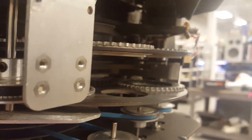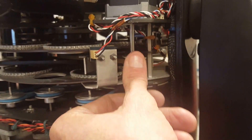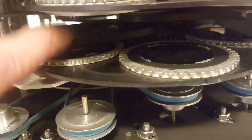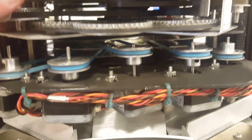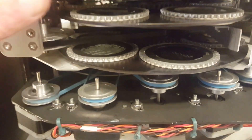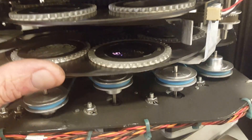If we move to the gobos — you have the gobo index, which makes the gobo spin on itself, and you have the gobo rotate, which spins the wheel. The way to adjust the index belt: it needs to be a little flappy, because if I put too much pressure on it when I try to move it, you'll see that the wheel will tend to rotate. If you put it really too tight, when you're operating the machine you'll turn on the index and your whole wheel may begin turning and lose steps.